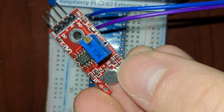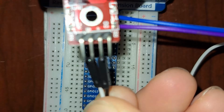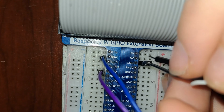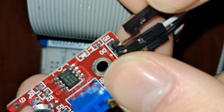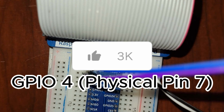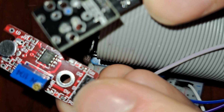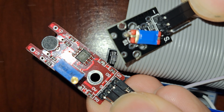Next we need to connect the microphone sound sensor. Then we need to connect the VCC and ground pins to 5 volts and ground on the Raspberry Pi respectively. Then connect the data out pin to GPIO pin 4 on the Raspberry Pi. Then you should have everything connected to the Raspberry Pi. Full complete instructions will be in the description.